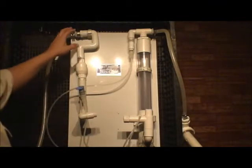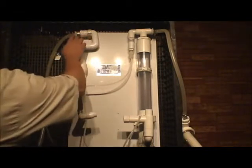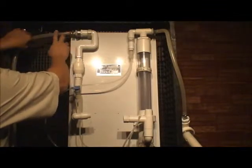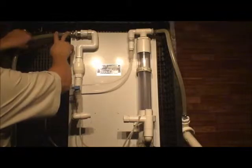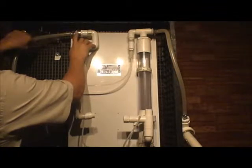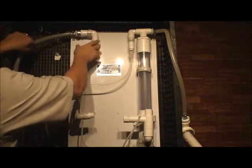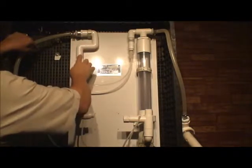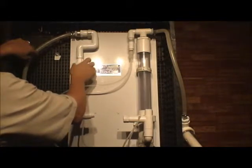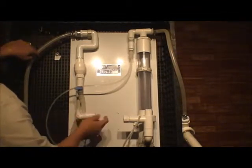As you look here, you have your water, and what I used here is water tubing, but this water tubing could also be a PVC line, okay? The inlet threading here is approximately one inch, and that 1 inch is a female pipe thread that goes into a plastic fitting. The plastic fitting goes through a check valve, and then this check valve feeds down into the lower end of this fitting, where it is actually going to feed the pump itself. So the Olas pump sits right there.